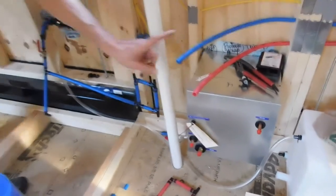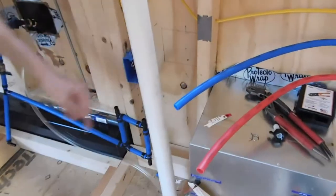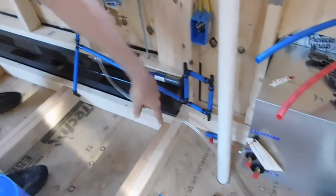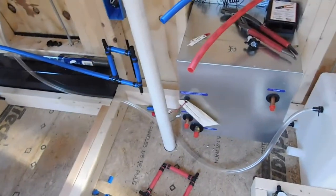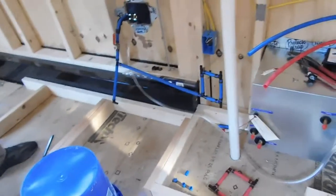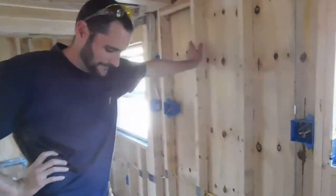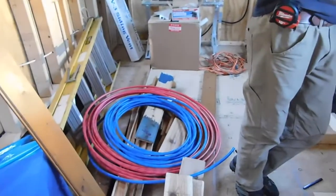This is going to run to the freshwater pump. This one is going to hook to that line that's going to go through this wall. This one's going to go up to the sink, and that one right there is going to go down to the hot water heater. And once we have more wood in there, I can secure it to everything. Tiny house plumbing. Looks good, honey.